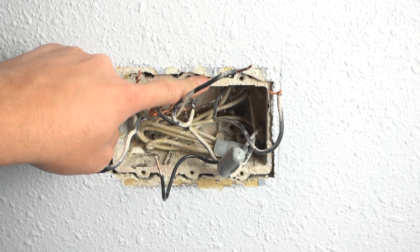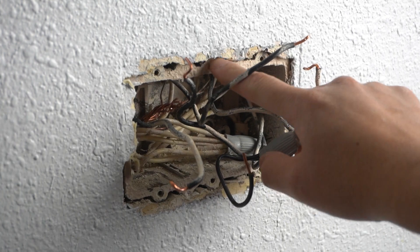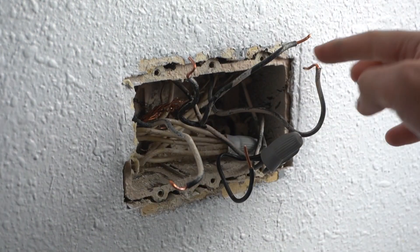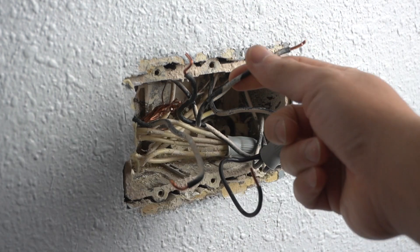We're going to change out some connectors to better ones. The J-Box here is sinking in towards the wall — here's another angle where the box is slowly sinking into the drywall. There's also a lot of overspray of texture inside the box as well, and on the wires.